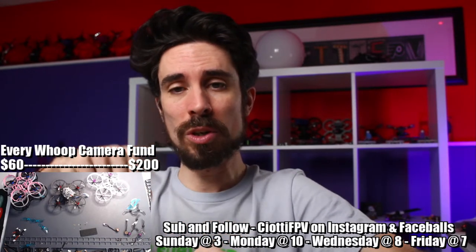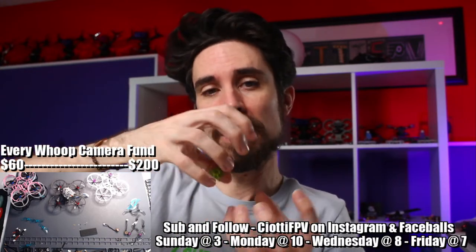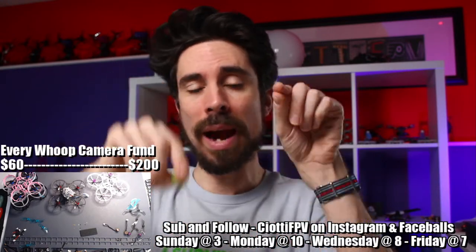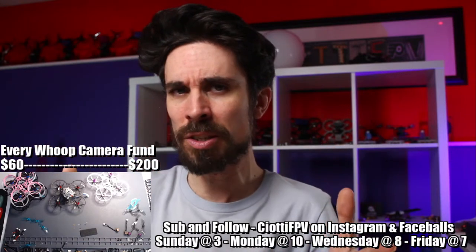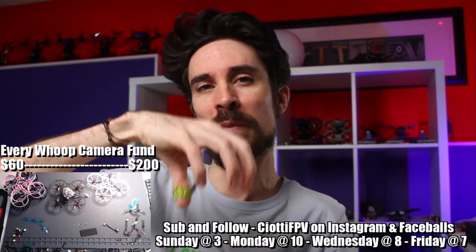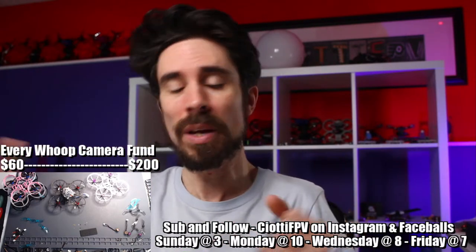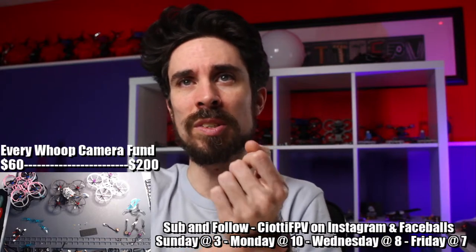If you do it, do yourself a favor and put a big glob of E6000 over your work when you're done, because it's not strong. It looks like it would be strong because you solder the grounds on the left and right and then the signal in the middle, and just looking at it you think, oh yeah, that's strong, but it will wiggle free and it will pop off. So do a big glob of E6000 on top of the whole thing. E6000 is cool because you can pick it off with your fingernail and it all comes off in one heap, just like hot glue. I guess you could also do it with hot glue. I would do E6000 though.